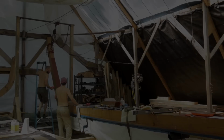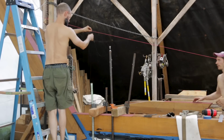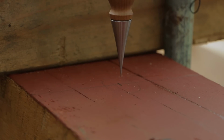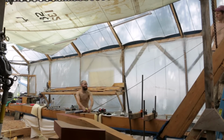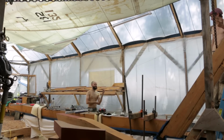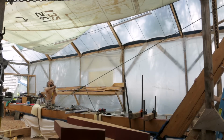Okay, back to the boathouse where we need to check alignment before putting anything together. We just gotta run that out to the center lines. You're like an 1/8 inch over the center line. This way? Yeah. Top of keel at station 8 is 137.5. Okay. 138. So, break that way 1/2 inch, not even. Close enough.